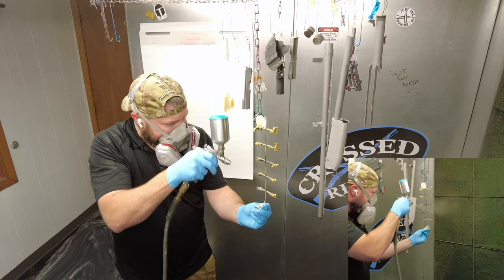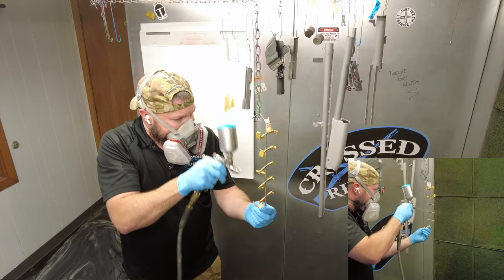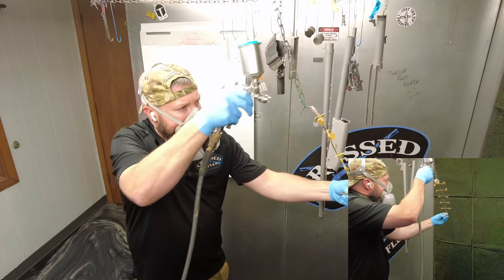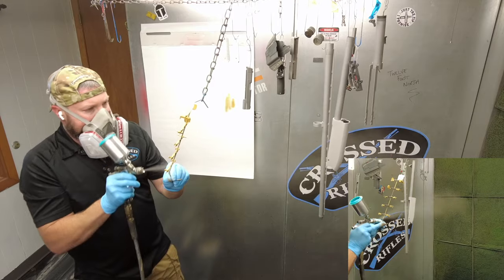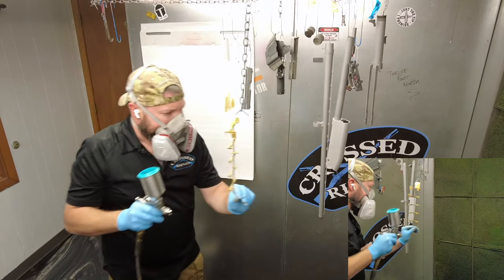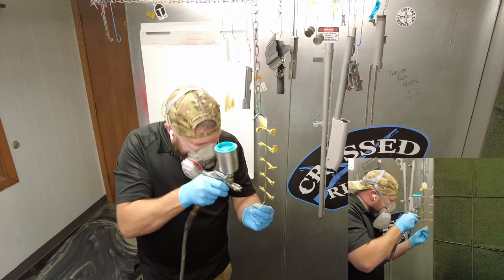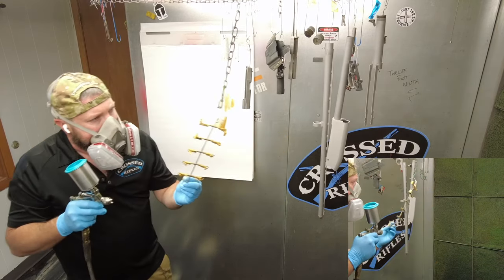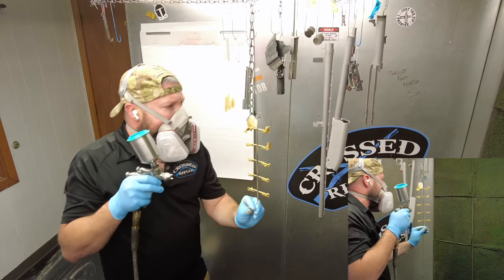Something I consider basic is how we're holding these parts — using the alligator clip piece from Cerakote. I'm moving at that 45-degree angle, getting a good final coat, then flipping it around and doing it again from the other direction. That's where we get our true one-mil thickness Cerakote spray. You can also see how quickly material is ventilating outside the booth. You should be clearing that Cerakote out of your area pretty quickly — you should not have any Cerakote buildup on the walls or in the air as you're spraying, because it'll ruin parts that are hanging prepped and ready to go.